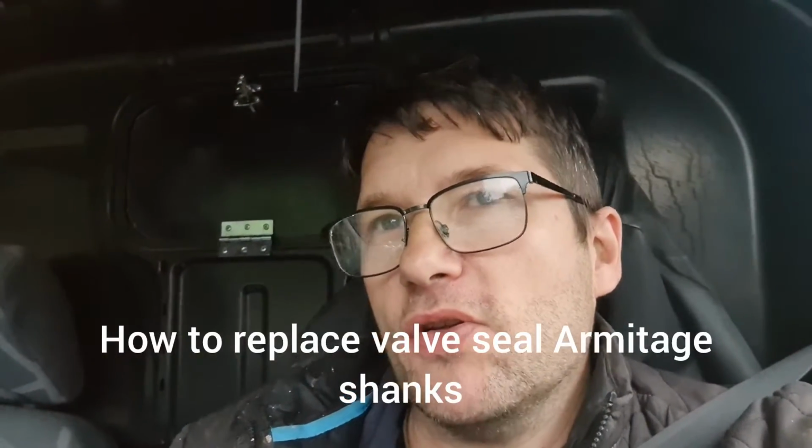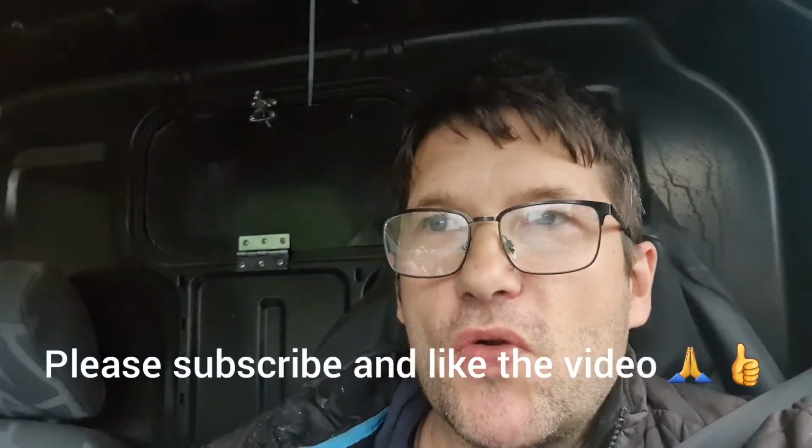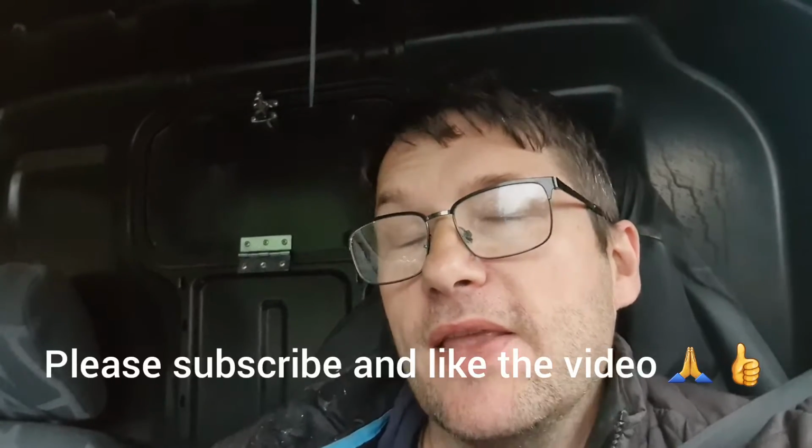So in this video I'm going to show you how to do some basic plumbing in a concealed toilet. Now this is an Armitage Shanks toilet and it is in a concealed unit. They are not the best of toilets to repair anything because you cannot see anything that's going on behind the scenes. Now I've been to this toilet earlier this week and ordered some parts that it requires, namely a rubber seal that goes on the base of the valve which seals the toilet, so when you press the buttons it releases the water down into the toilet pan.